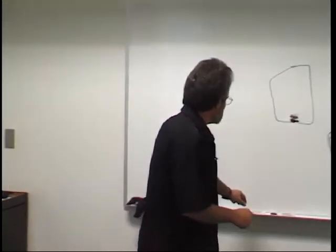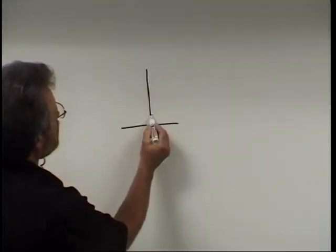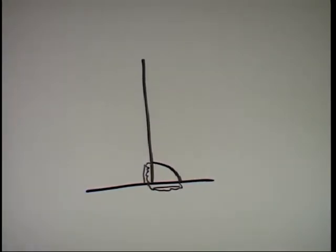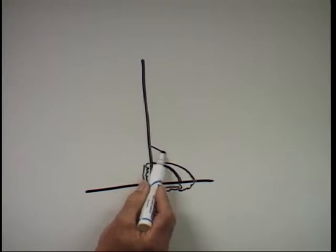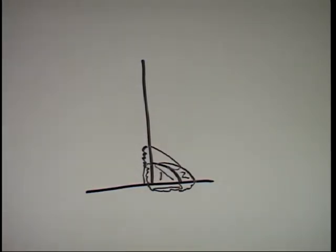The second bead should fuse thoroughly into three-fourths of the first bead and extend one-quarter of an inch out from the bottom plate. The third bead should fuse with the first two and extend to the edge of the top plate. Your first bead is going to lay in here and you're going to make sure you have the same amount of metal on each plate and get good depth of fusion into those two plates. Your second bead should cover most of that first bead, and your number three bead will cover one-half of the number two bead. You want good depth of fusion into the previous beads — that's how you get a strong weld.